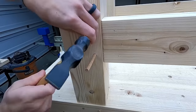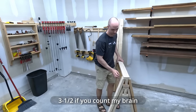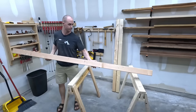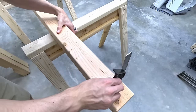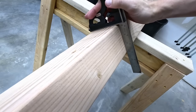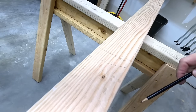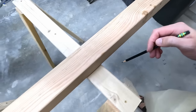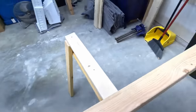I think I only used like three tools for the whole thing, because if you haven't been following along, I'm building out a workshop in the corner of this garage using just a few basic tools. This four by four will make the legs of the bench, and the weird thing I've noticed is that there is usually only one squared up corner. The rest are way off, so I find the good corner and mark it out. I mark it up and down the post in a couple different spots because I am just about to chop this baby up. That squared up corner is going to be the outside on each of the bench legs.